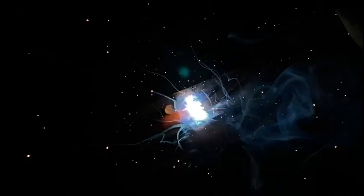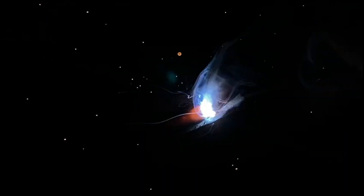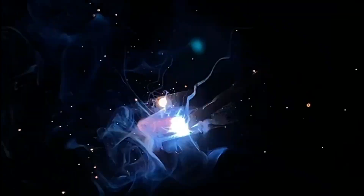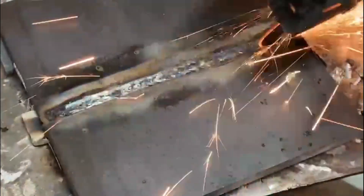Maintaining that drag angle is key because we are trying to keep the flux out of that hole. If the flux gets in there too much it'll push the metal out of the way, giving you lack of fusion. We're coming towards the end of that run now — we've got a bit of a run-off plate that we just drop down onto. We clear the slag off and then give it a quick tickle with a grinder to make sure there isn't anything left on the surface that's going to cause any inclusions for our next run.